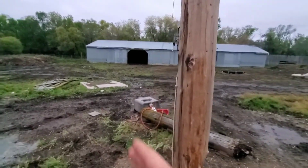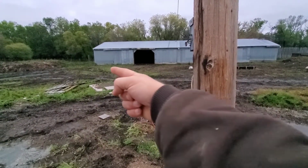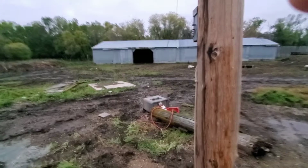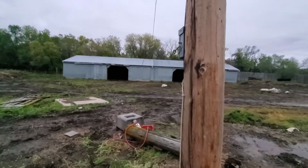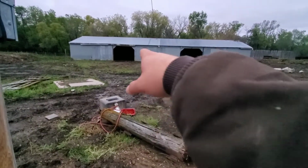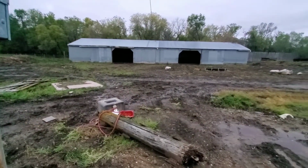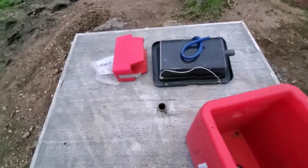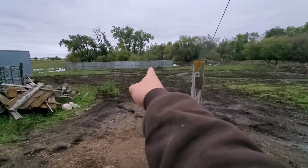The old fence went over. You can kind of see I dug this ditch here, and it got just on the other side of there, right where that ditch was, and then angled that way and went over to the corner of the barn. The reason I'm going to do it this way is I'm going to build a well pipe panel and a gate for inside the barn, and I'm going to have that barn cut, not in half, but right at the same spot there. So this side will be for this side of the fence, and this side will be for this entire side. Also, we got this guy here, which is going to go up and meet at that third post down, this one right here.